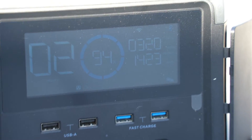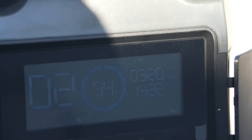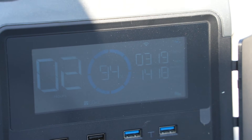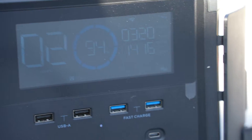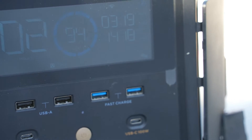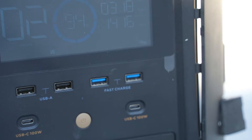Really good production, honestly — 320 watts from a 400-watt array, with all four panels in series. That's really good. Again, the angle may not be perfect, and of course it is late December so we're not getting a ton of sun, but really, really good. I'm impressed with that.